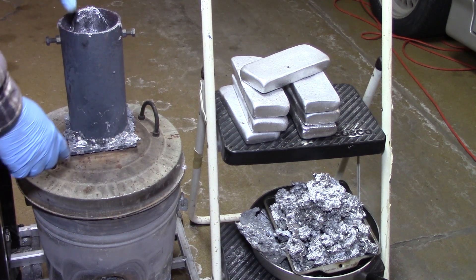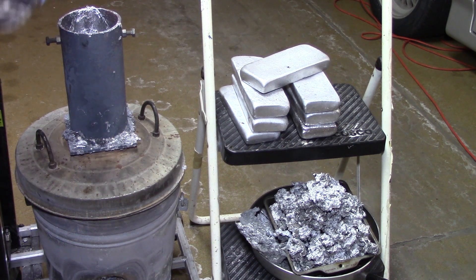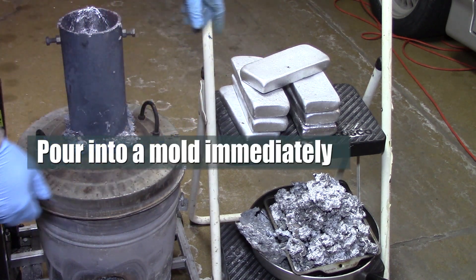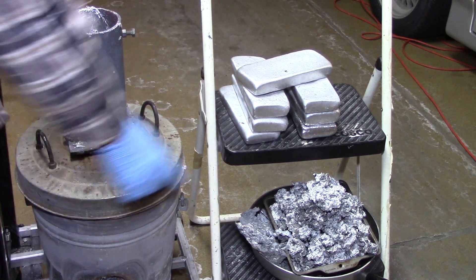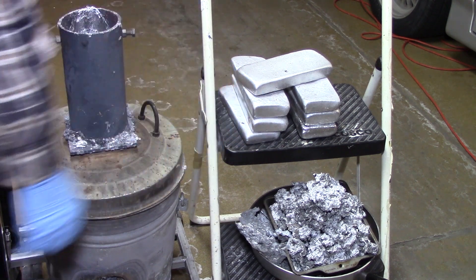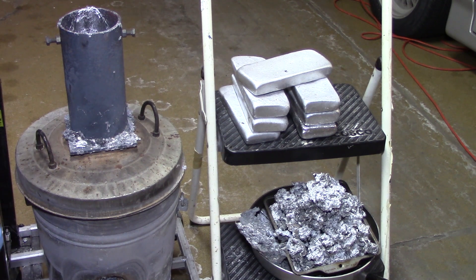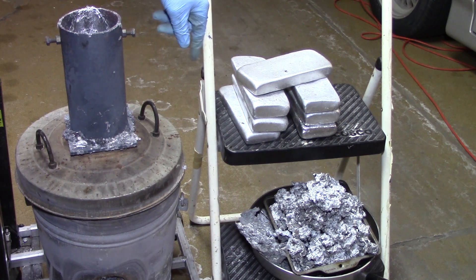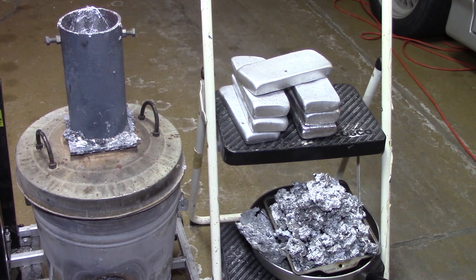The aluminum cans — there are guys that say it's not worth melting them. I wouldn't melt aluminum cans to pour directly into a foundry, but if you're just trying to get stock like this and you've got time, it does create a lot of waste. I'm going to try to get some of the aluminum out of that waste. There's a lot of paint and varnish on the inside of those cans that comes out and turns into ash and garbage, but it does give you good aluminum. So thank you for watching — hope you enjoyed this. We'll see you next time.